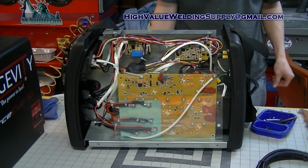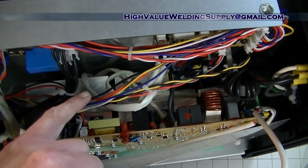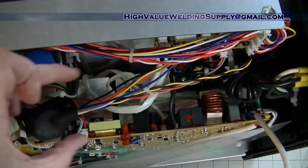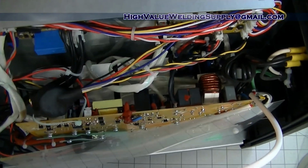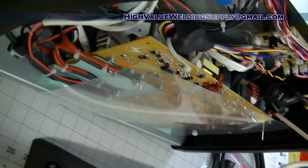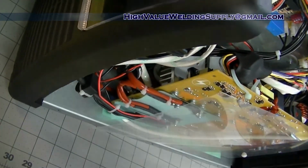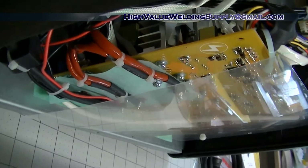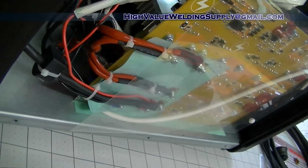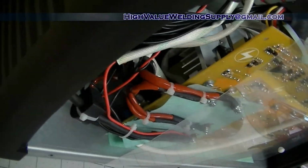So let me come around there and we'll get a close-up look at this thing. Alright, now you can look down in there and you see the aluminum, looks like blocks in there. That is the heatsink cartridge that's down in there. If we take this and lean it to the side here, you see right there, that's the cooling vanes I was talking about hanging down. Basically what you get down inside of there is a tunnel that has cooling vanes on the top and on the bottom. And then you have components strung in through there as well.